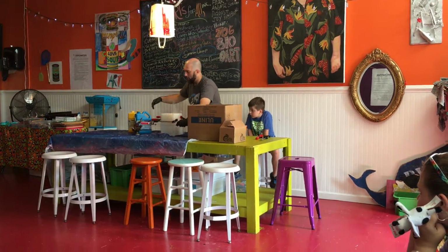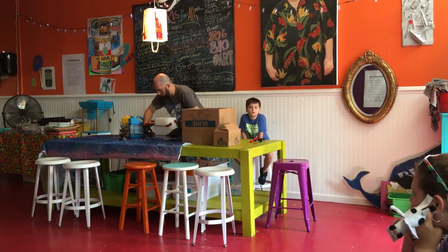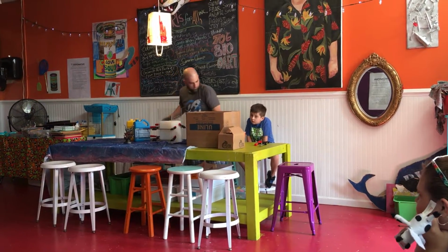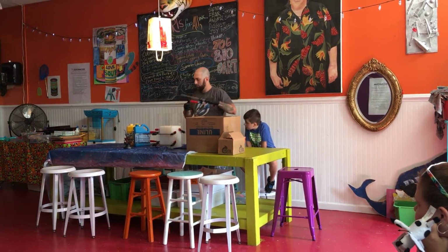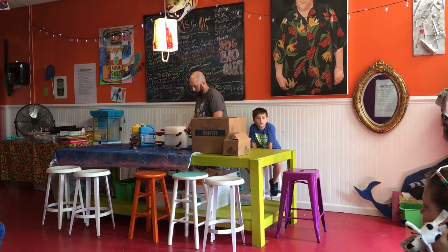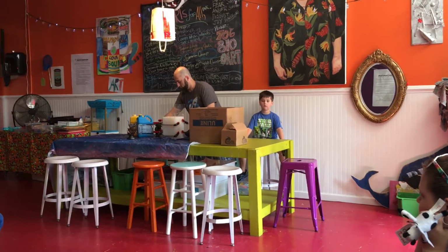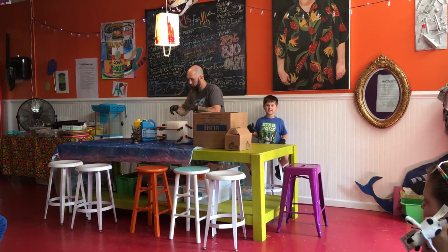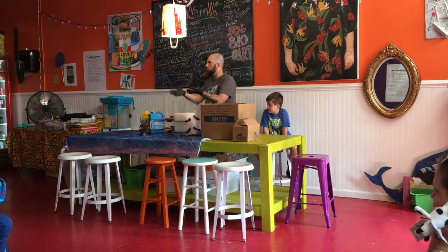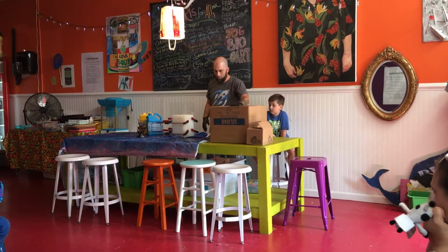That's awesome. I want to make sure everyone understands that he's really dealing with positives and negatives. Yes, that mold is negative. There's negative space on the inside of that mold. When he pours those agents in there, those two things he's going to mix together to form that plastic, it's going to create positive from the negative on the inside. You understand that, everybody? And once we pull this out, I'll take the mold around so you can see the details on the inside, or have you come up and look at it.